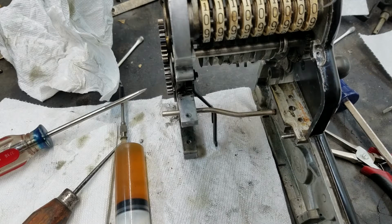So basically you'll be trying to drive this gear to push out that detent into the peg, and it'll jam because it'll be hitting that peg, and that'll stop the detent from coming out, which will stop this from rotating, which will stop that shaft from turning. So if you're off by one tooth, that's what will happen.